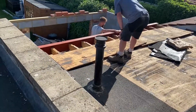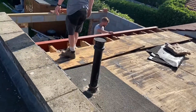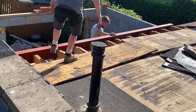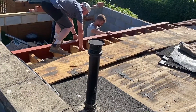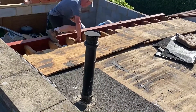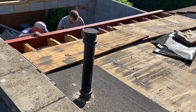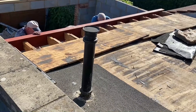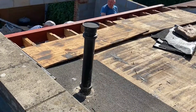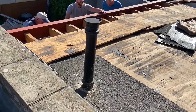If we have a look from the other angle, you can now clearly see how the joists fit into the I-beam. In the central section, just close to where the pipe is where the guy's standing, we've cut out the top section of the beam. In the one next to it you can see we've cut a little notch into it — that's just making sure it fits really tightly into the I-beam itself. Because this is basically the support for the whole of the roof, this I-beam will keep that end of the roof stable and make sure there's no movement, then we'll just need to fit the new joists in on the other side as well.